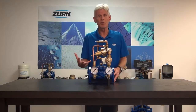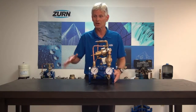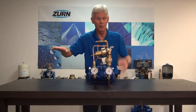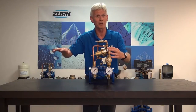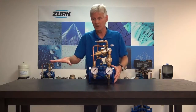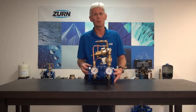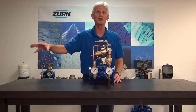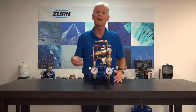What we would do is set the sustaining function such that if this inlet pressure ever dropped down to a given value — which we would adjust ourselves — this valve would begin to close itself off, thus maintaining a given inlet pressure. This may be for an application where we have equipment attached to the inlet side that is very pressure sensitive, and if that pressure falls too low, that could harm that equipment.